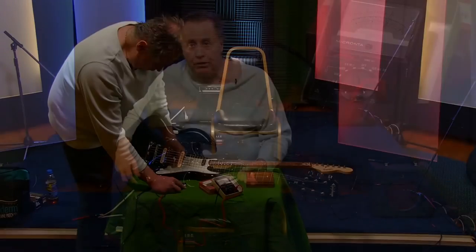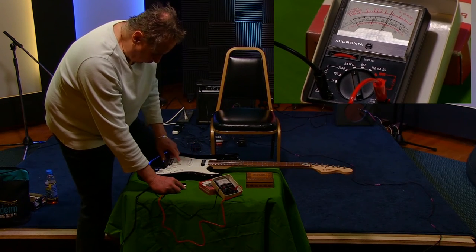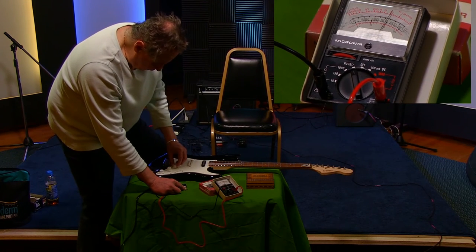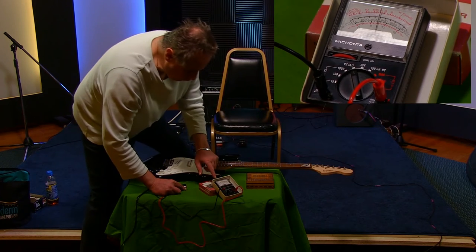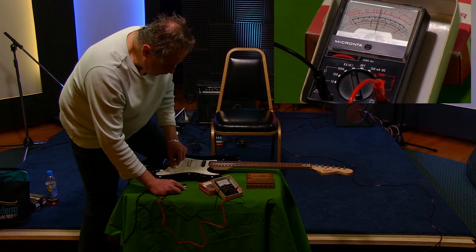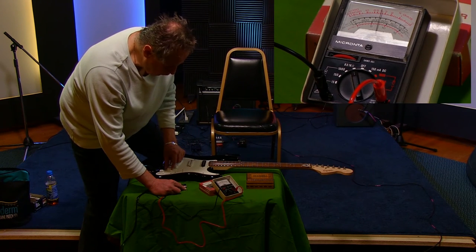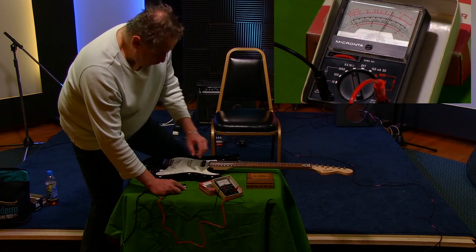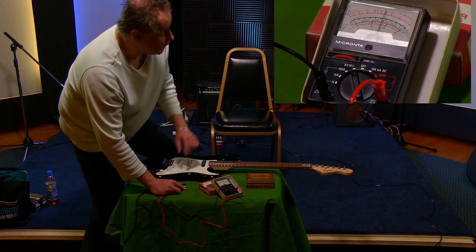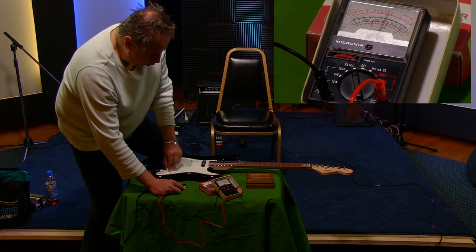I can show you on the meter. You want to get a close up on the meter, but I can show you how it dials in on that other one. These two white pickups are in parallel and they're connected to these two volume pots. When one pickup is up by itself and the other one's turned down, the meter reads 4K. When you dial up the other pickup, because they're in parallel, it lowers the resistance down to 2K. And you can blend how much it lowers it by adjusting the dial. You can't do that when the switch has them both full up.